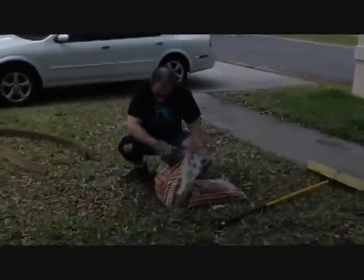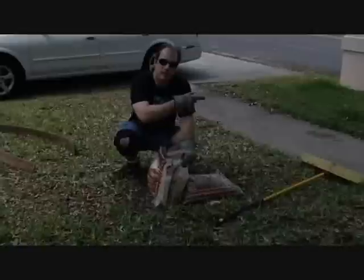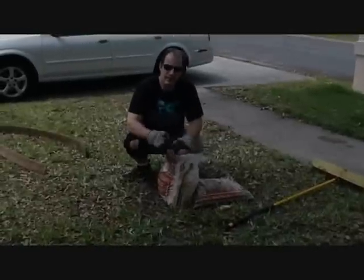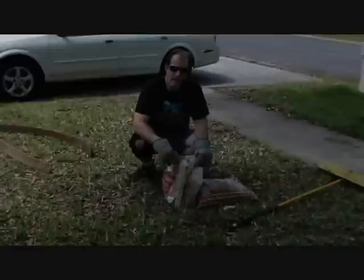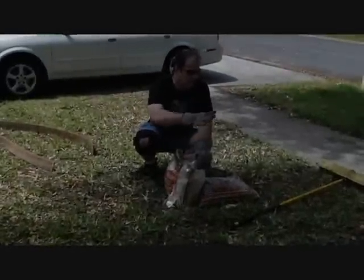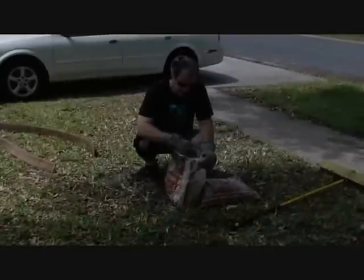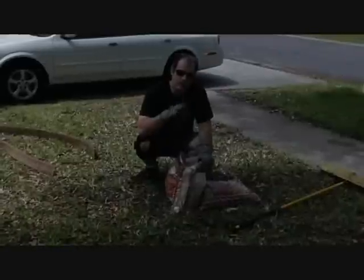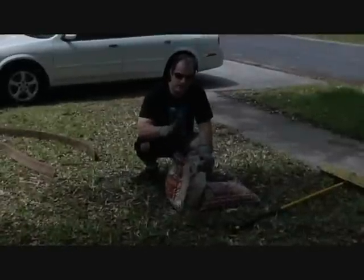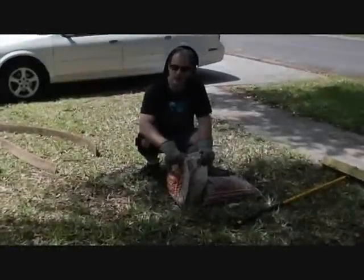This is leveling sand. What I'm going to do is put the leveling sand underneath the blocks — makes it a little bit easier to level them out as we go along. I've got the dirt pretty much where I know it's level, but I'm going to put this in and stomp on it and get it nice and compacted so the blocks don't move much when it rains. The soil will be nice and compacted.